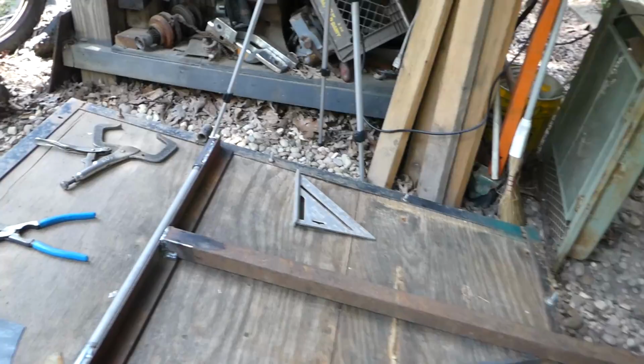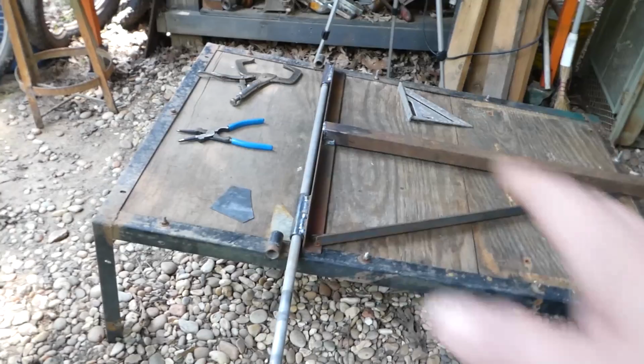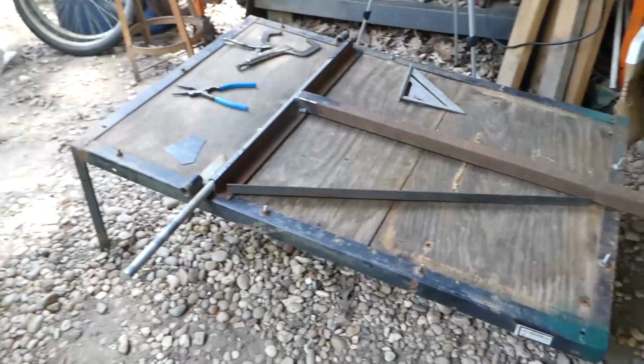So that's a consideration. I'll just have to use it and see. It's very, very simple to just move the axle hubs a little bit farther forward, maybe 60% of the distance. This looks like it's more like 75%. Sort of learned this lesson the hard way about trailers following vehicles or not following vehicles or kind of making their own cut.